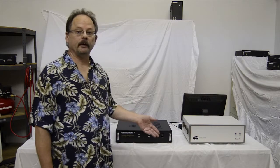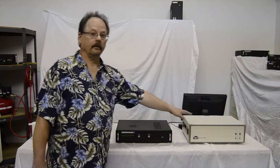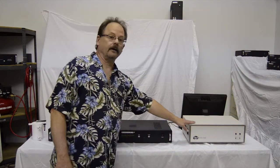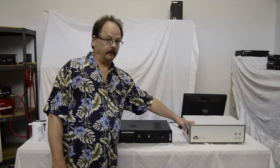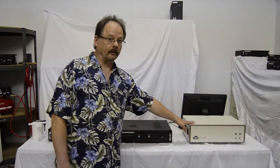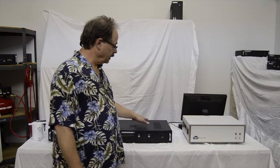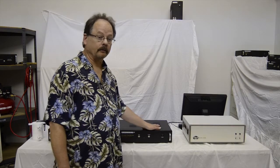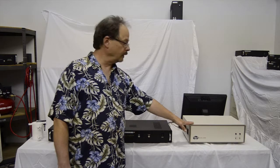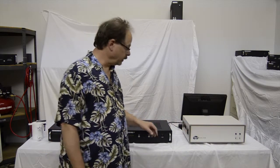One thing I need to caution is that many customers will buy the 10-volt option with the intention of filling the gap between 10 volts and the limit of their amplifier by using the external amplifier. This is a 10,000-volt, 1,000-gain amplifier, and it's not recommended for use below 500 volts. If you intend to fill the gap between 10 volts and 1,000 volts, I recommend a 1,000-volt amplifier with a 100 gain — a lower gain — and that will give you better precision in those ranges.